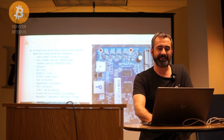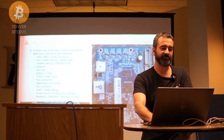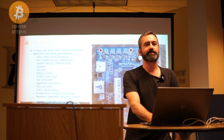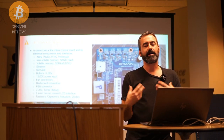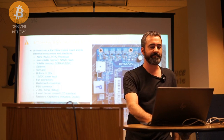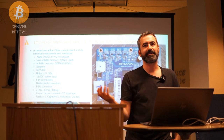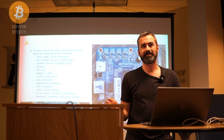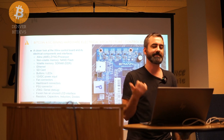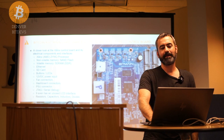It's got the buttons and LEDs on the front panel here. The fan connectors over here. And then I had this picture because of another hardware configuration example: Bitmain started coming out with higher-powered fans. It probably needed them for these newer machines. So they started using these 2x2 Molex connectors instead of the old style of connectors we've seen all these years since 2016 and before. All of a sudden, the K-Pro, S19A, S21, T21 started coming out with control boards with all four of them.